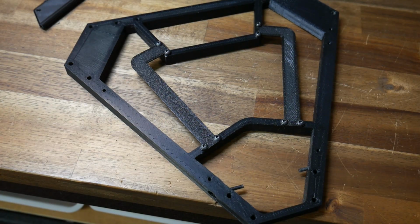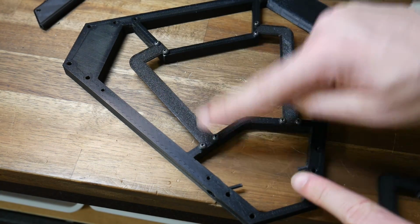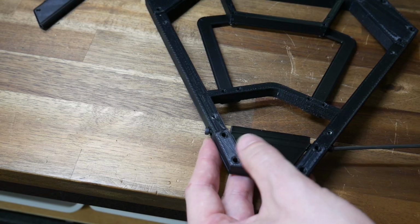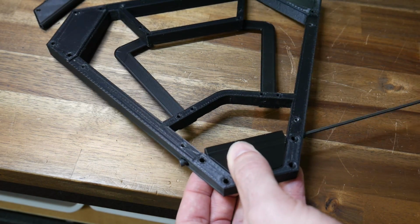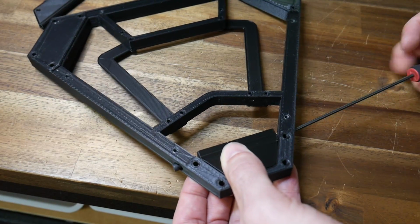The next part of the frame needs some pre-assembly, putting on the 2 flaps. Printing these at 1.5mm thickness worked best for my setup. The other piece that needs assembly is the little inspection flap, and you use 2 M3x16 bolts from the sides to secure it in place.